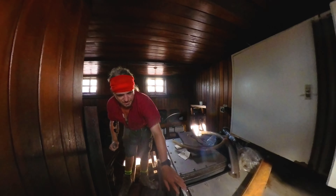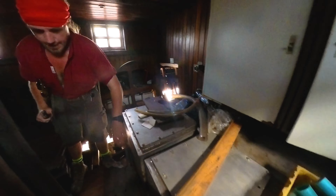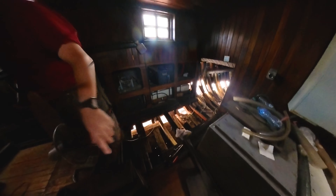Here's my fuel tanks - these were recently redone. I had them clean out the inside. Actually, this is a water tank and this is a fuel tank. I do kind of wish they put the water tank lower - it doesn't quite go down as far as I'd like. I had them put on these inspection hatches so I can clean them easier. My fuel tank actually runs all the way down under here and goes this way to about that line there - that opening. So you get that weight low and lots and lots of fuel - good for motoring if I have to. And I've got a big motor. But again, like I said, that's really expensive to use.